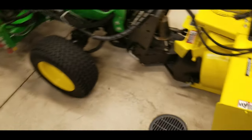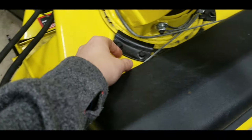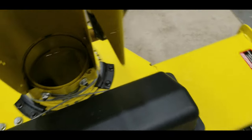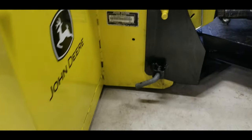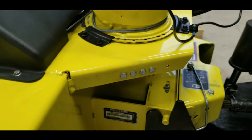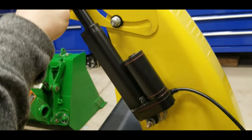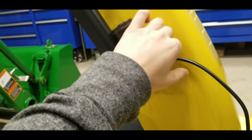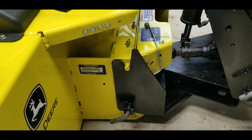On this one - sorry about the water - but just from the way the snowblower sits, it's actually wearing into the steel on the back here. Their rotate looks like it's a motor instead of the weird funky cable system that John Deere has. This side's a little better to see - that's just from rubbing on the ground. I haven't even used hardly any of my cutting edges yet. They come back with an electronic actuator as an option, which I kind of cobbled together myself - and actually that's what I need to work on today because it stopped working.